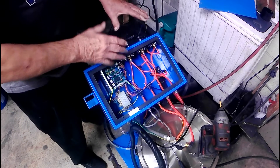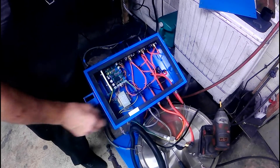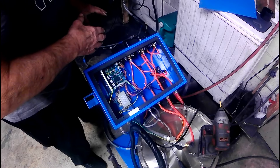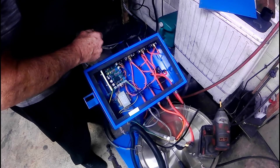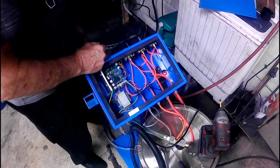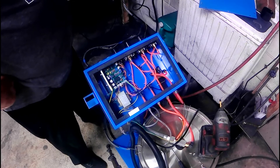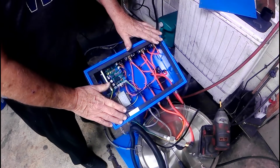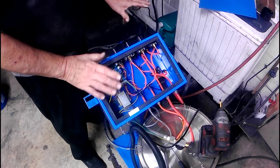What was happening before is my air compressor was running non-stop because air was continuously running through the hose, which was causing powder to accumulate in spots and then burst out as clumps before straightening out. Now it throws a really nice mist all the time. I could have probably built this from scratch with the time I've put into it, but I'm happy it's working.